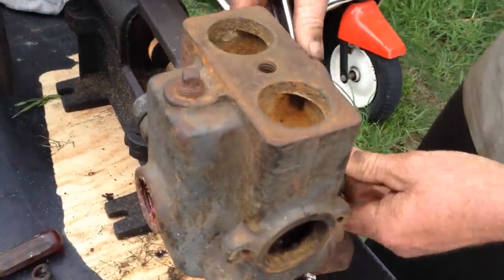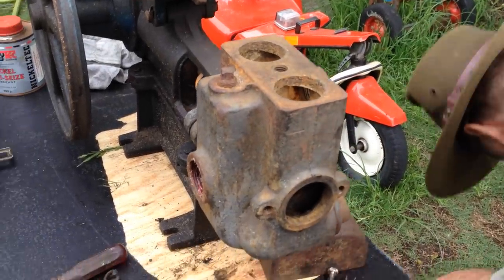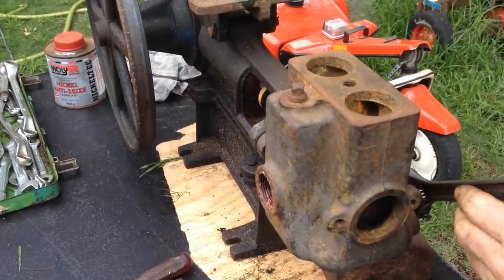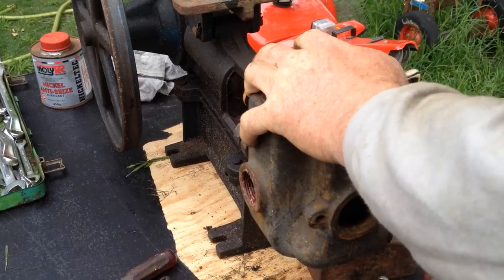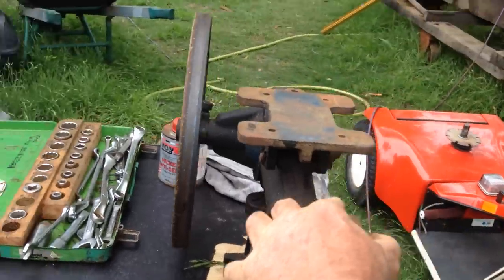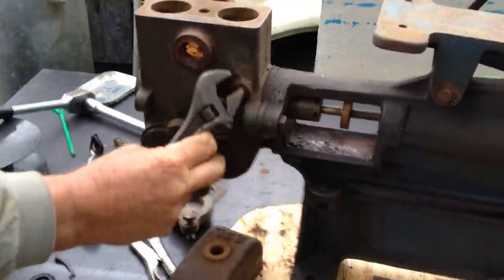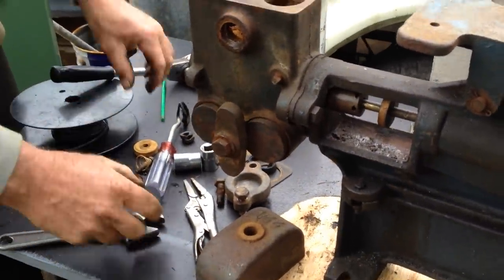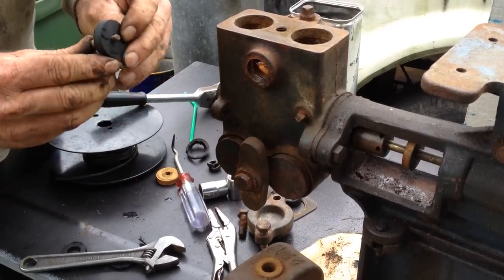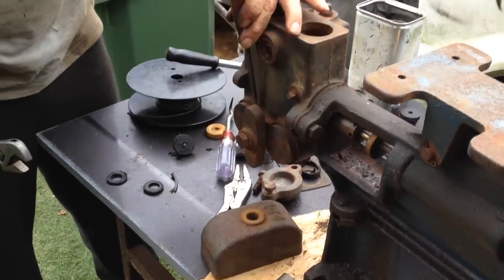And the valves are pretty simple. You just make sure rubber side faces down. Some people will put them in and have the brass part touching onto the other brass part. Well, that's wrong. You've got to have it where the rubber sits down first, then your brass washer, then your spring, and then your screw, in that order. No other crazy way. It's there to seal.